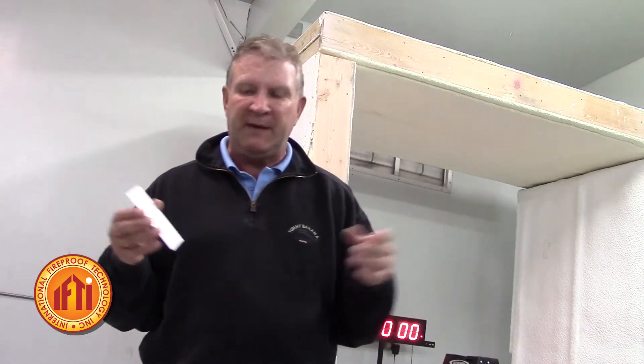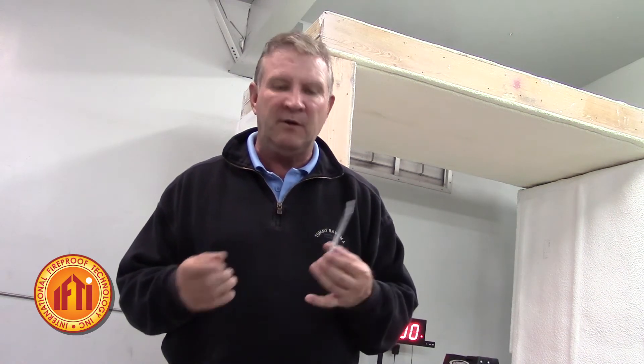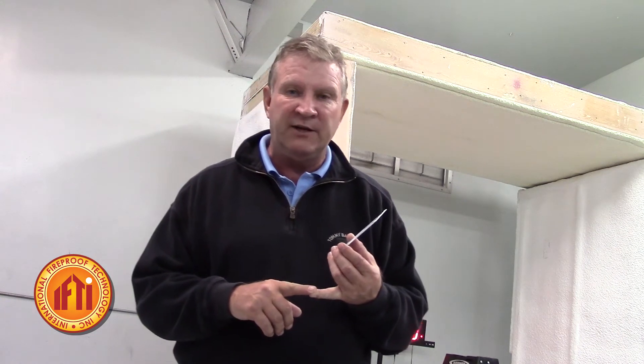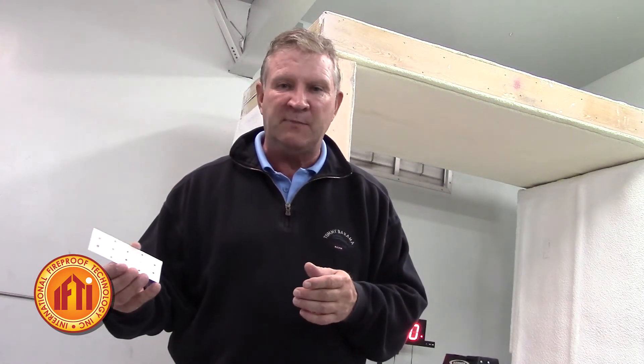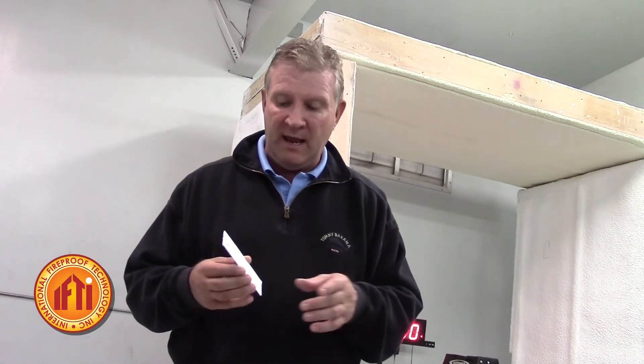If you pull these plates and you have 10, 20, or 50 — it just depends on the job — make sure they dry before you stack them up and put them together. We suggest taking a copy of possibly the invoice or packing list of the product that you use. Put down the job location, some way to validate the product, maybe a test report. Put these away in a plastic bag and present them to your inspector, your fire marshal, your final sign-off. You keep them for yourself long-term in case there's a problem in the future.